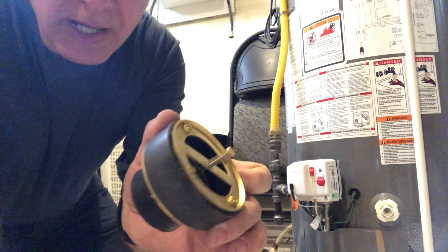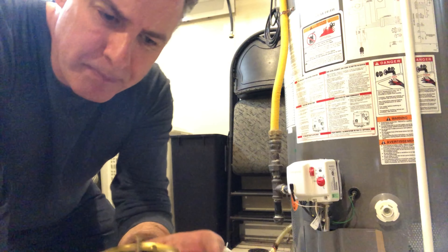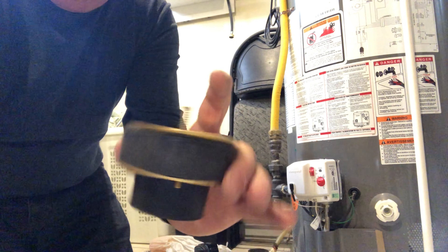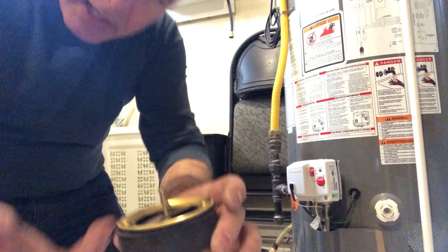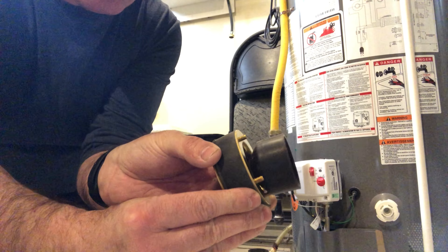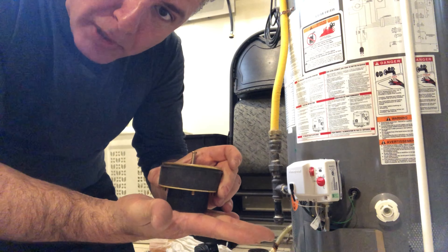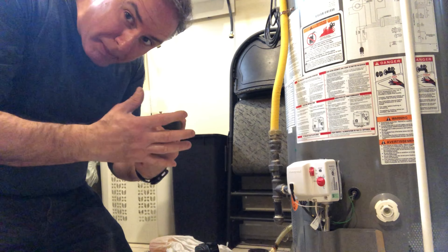This is a typical three inch, so make sure that you measured and you get the right one. This little button here is spring-loaded — once water goes on top to the drain, it'll push down and then you'll see the air go down, then it comes back up with the spring. Once it's at that position, anything that's coming back this way will just add more pressure, so it'll stop. I don't know if it's going to be 100%, but it still prevents you from having a major three-inch opening rather than maybe just an eighth of an inch or a sixteenth.